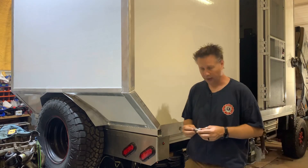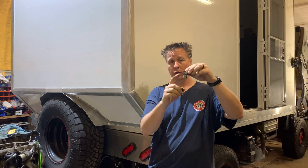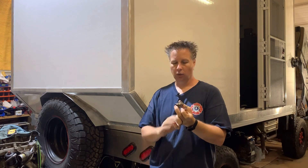That definitely sounds like it's doing what it's supposed to. Well, that didn't last too long, but I think that's a good thing. What happened was the weld between the nut and the elbow adapter that I made sheared in half. But that tells me there's a lot of force going from this part to the nut, which is attached to the injector. I'd really only done two really small tacks on here. So with a much bigger weld around there, I don't think I'll need to worry about that. And now I know there is a lot of pulling force going to the top of the injector.